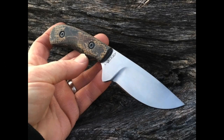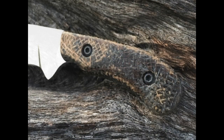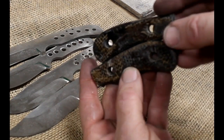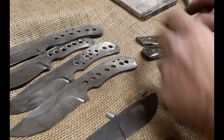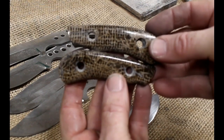The colors look good, but it's almost as if the fiberglass resin didn't completely impregnate into the fibers of the burlap. So it has a very coarse grit and you can almost feel the fibers — you can see the fibers through the resin. I just was not happy with them. I figured out what the problem was: I think when I stained the burlap, that dried wood stain prevented the fiberglass resin from really getting into the burlap fibers.